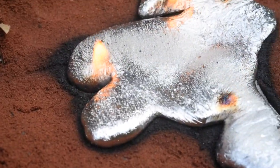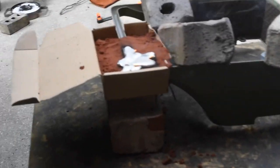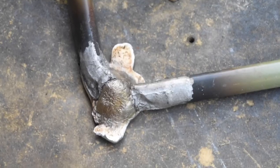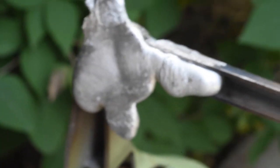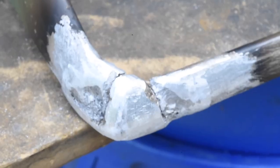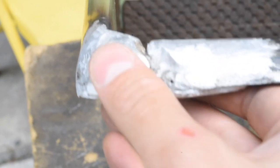This was a more successful pour and it should leave me plenty to grind off — maybe too much. I used a smaller box and a lot more clay, so we're just going to let this thing cool. Here we have the final pour; it's going to take a lot of work to make it look pretty. There's still some warpage on the original body panel. I'll have to use some bondo to fill in the gaps, but the core structure is all aluminum so it should retain strength. I purchased an angle grinder to remove a lot more material off the bottom and some bondo to fill cracks and divots that didn't quite get filled during the pour.